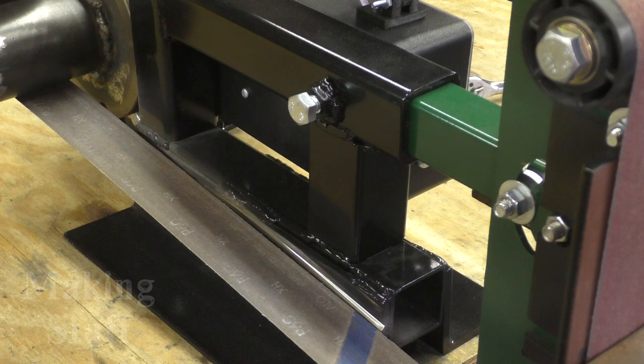It's a DC motor, so I could have reversed the motor, but then there was a chance that the flywheel could loosen itself if the machine had an abrupt stop. And without the belt and everything on it, playing with it, it was quite easy to get that flywheel to unscrew itself from the shaft of the motor. So I decided to put the belt on the left-hand side, and that solved all those problems.